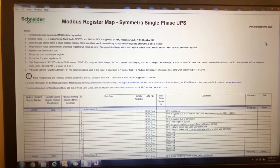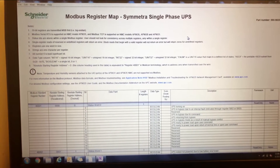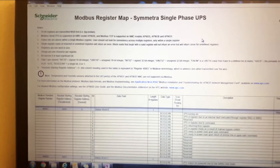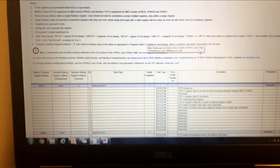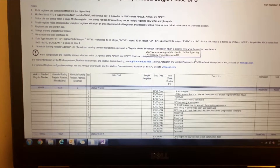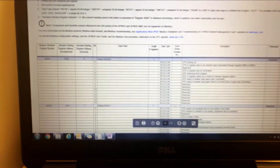I know it's a single-phase UPS shown, but they're mostly the same — they have a designation for each phase of the UPS, so phase A, B, and C. The boolean characters for status are just generalized. For instance, this is that register for 40001, which gets unpacked and then each bit here corresponds to a boolean. In this case these are just statuses of what the UPS is doing.